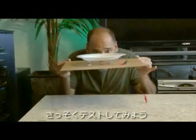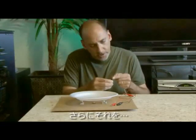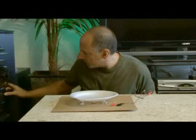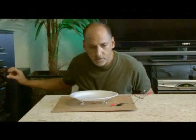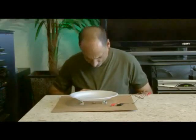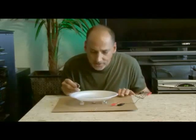Our styrofoam plate speaker is built and ready to be tested out. I've hooked up a couple of jumpers to the wires going to the coil, and now I'm going to hook up a line that I've run to my speaker output on my receiver, and now we're going to play some music and see what happens. It sounds excellent considering it's a styrofoam plate — a cheap and easy project, and it's kind of fun. You can experiment with different size magnets, different amounts of windings around the coil for different results. And there's our styrofoam plate speaker. We'll see you next time with another weekend project.